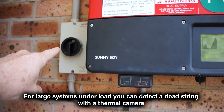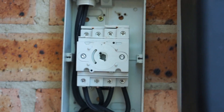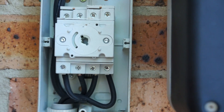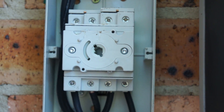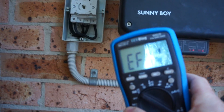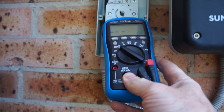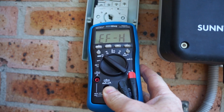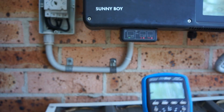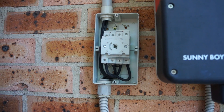First thing I'm going to do is measure to see we've got voltage coming from the roof. Taking the panel off, you can see it's just a big switch block — two wires coming from the array at the top, and two wires going out — just a dual-pole switch. Using a non-contact voltage detector that does both DC and AC, the same as those Fluke non-contact voltage sticks. Not detecting anything on high-sensitivity mode — that's not a good sign. I think we're going to measure zero.